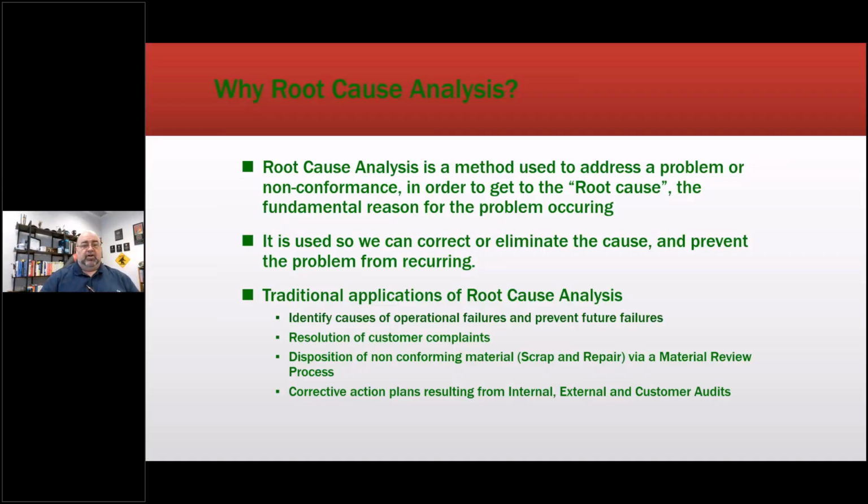Well, that meant that they overcooked it. When they went through the curing process, there must have been a problem. So we took a trip down to the wire manufacturer. They had the wire drawing area and they were doing a pretty good job there. But when they went to the spot where they were putting the enamel on it, I talked to one of the operators, who said, oh yeah, we replaced everybody. I'm from the old group. I don't like how they're having the temperature increase.